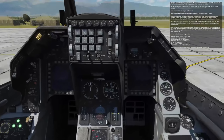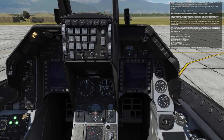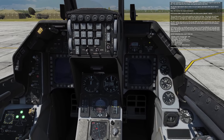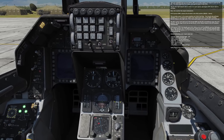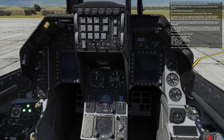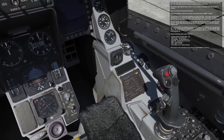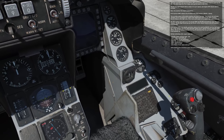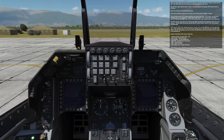All aircraft systems are now running off electricity from the generator and are ready to be powered up. Normal indications after engine start are: hydraulic and oil warning lights off; fuel flow between 700 and 1700 pounds per hour; oil pressure 15 psi minimum; nozzle position greater than 94%; RPM 62 to 80%; FTIT 650°C or less; and hydraulic pressure for A and B between 2850 and 3250 psi. Verify those on the instrument panel.